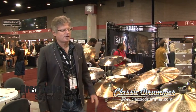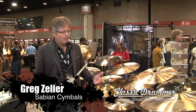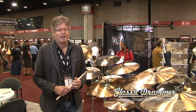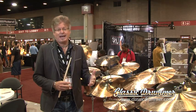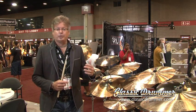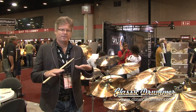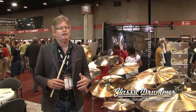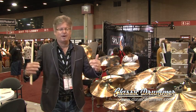First thing I want to show you is some of our really premier high-end line, which is our Artisan series. One of our first series that we introduced was called HH, which was hand-hammered. We're really proud of the fact that we've maintained the ability to still hand-hammer cymbals. It gives us the ability to create cymbals that are very unique, very musical, and very dark because we can keep the profiles of those cymbals really flat, which keeps the pitch down. Real desirable for people playing in situations where they prefer the cymbals to blend with the music as opposed to cut above the music.